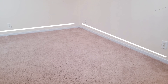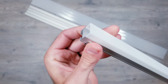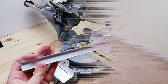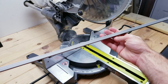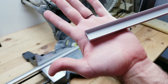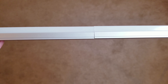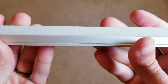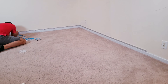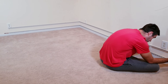I'm going to go ahead and hang up 10 meters of these channels to see how everything looks using the new strips. For a long-term install I'd use the brackets, but to avoid spackling holes later I'm going to use 3M strips to secure the diffusers to the wall. One thing I do to get as seamless a look as possible is to cut the aluminum profile in half using a basic miter saw — though a regular handsaw works too. This makes sure the plastic diffuser covers and the aluminum joints aren't coming together at the same spot; the plastic diffusers should meet in the middle of the aluminum profile. The back side of the strip has normal sticky tape like you'd expect, and in my brief time using these everything is still holding strong.